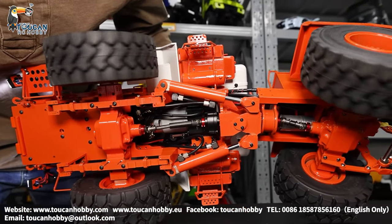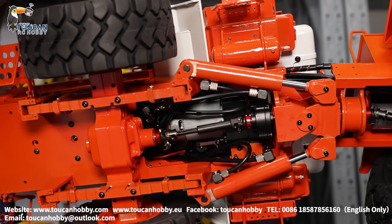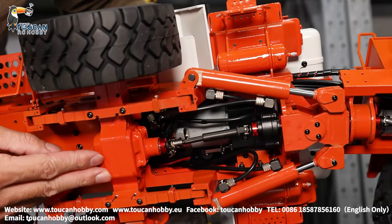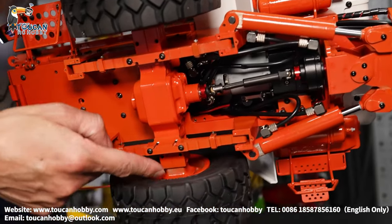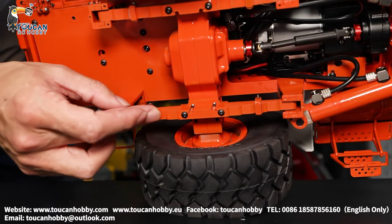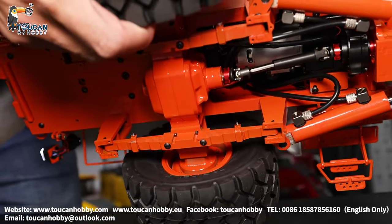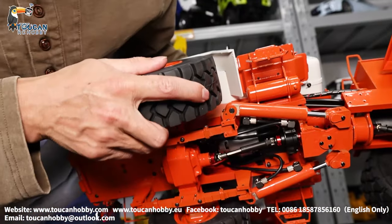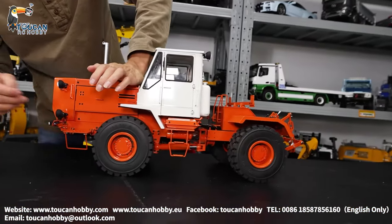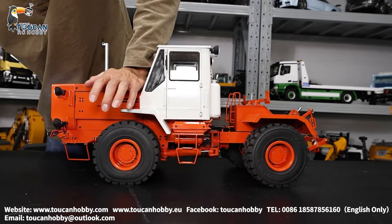Changing back to low speed. So the drive motor is a brushed one. And the front axle is also powered — same steel axle, also with hub reduction. And here this suspension — all metal plate, very strong. So even when compressing, it's only changing shape a little bit. When we put it down and press a little more, you can see how it's dropping. So for agriculture, it's a very strong one.